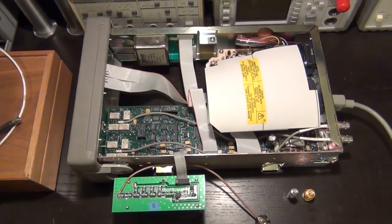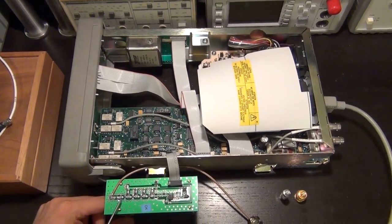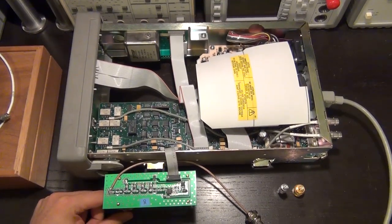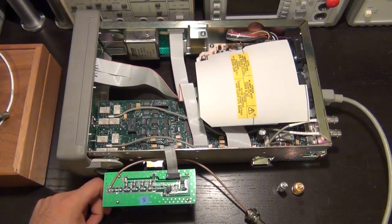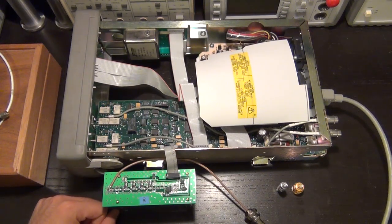And now let's walk through that. We looked at the data sheet of these components. We know that each of these little amplifiers has about 7 dB of gain. So 4 amplifiers in a row is going to have about 28 dB of gain. Let's say 30 dB of gain, even though it's going to be less because there are losses associated with the traces and the passives. But say 30 dB. So if this thing has a 30 dB gain, and we also looked at the output compression, the P1 dB of one of these amplifiers was about 10 dBm.